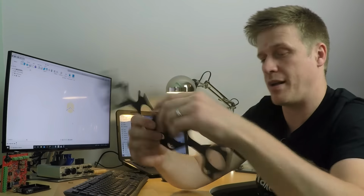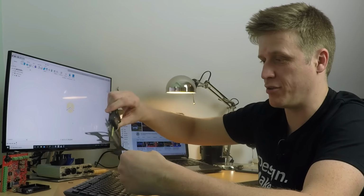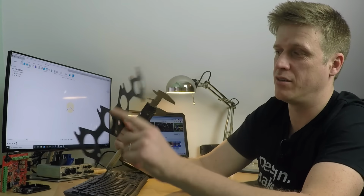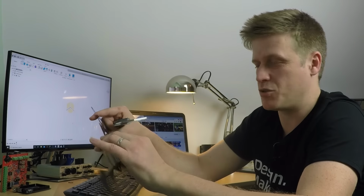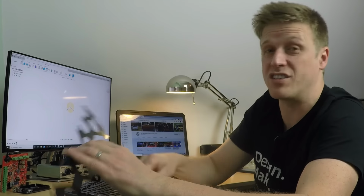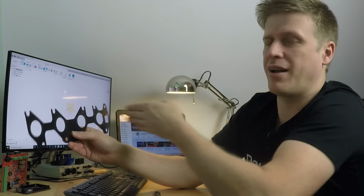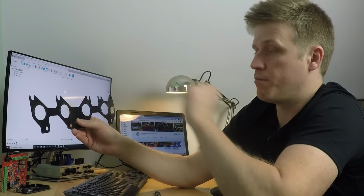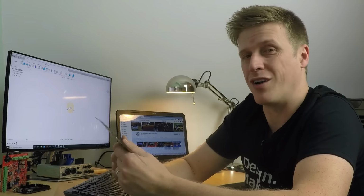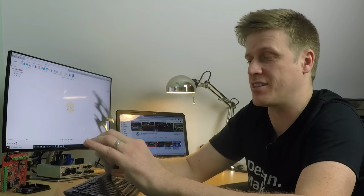And we could spend a lot of time with some calipers going around measuring every single thing. That's not too bad for the key dimensions, but for everything else, it's a bit tricky. Time consuming, certainly. Or we could take a photograph, and that works a bit better, it's a bit quicker, but unfortunately you've got a parallax error thing going to happen because you're only taking light from one point. Better than these is to put it on a scanner, because as the scanner goes along, it's only looking directly up, so there's no parallax error.